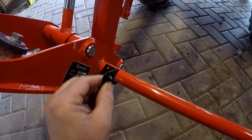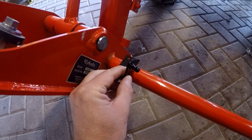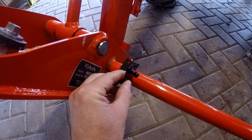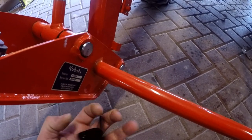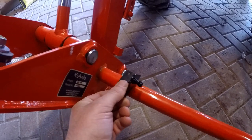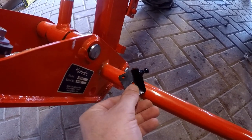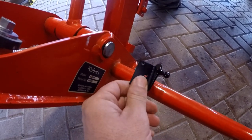First thing I'm going to do is mount this ball joint on this part of the bucket mechanism here. The issue is that obviously that's round and this is flat, and what I'm going to do is just take off some material here so that I can get a pipe clamp around it.